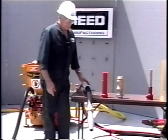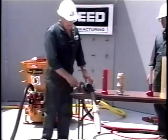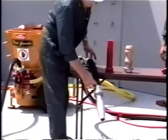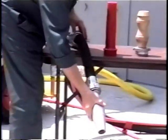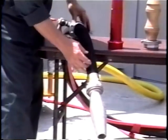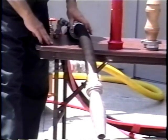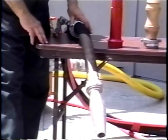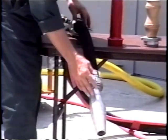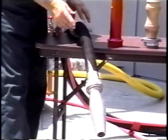One good setup is called a hydromix nozzle, where it's wet earlier and gives about two more feet of additional wetting rather than having just the tip in the wetting chamber. This gives a little extra mix. It is not difficult to handle and does a tremendous job on reducing rebound. It gives more time to mix — almost three times the distance compared to normal with just the tip.